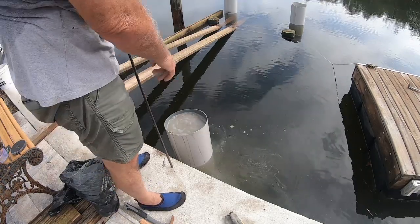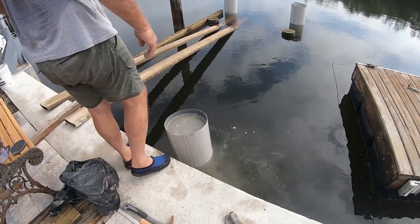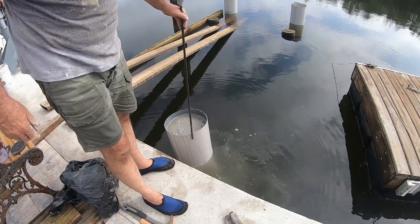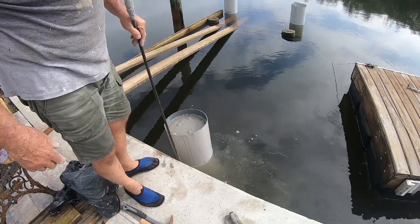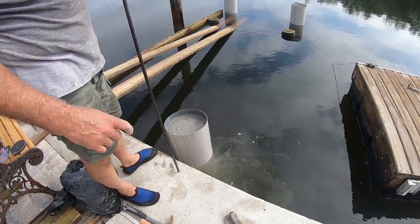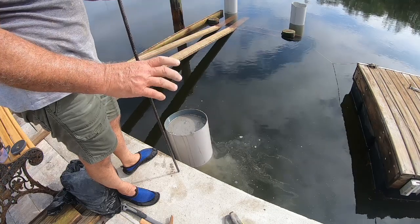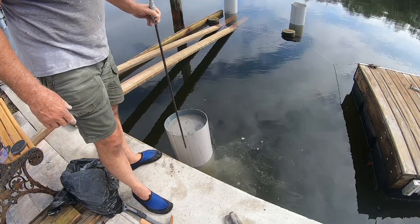So the plan is then, this is just water at the top. When the cement sets up, I'll eventually probably cut off the top few inches of this, which will be the width of one of these rafters, which is about 7.5 inches, plus the thickness of the decking, which is about an inch, 5/4 is an inch. So that's 8.5 inches down from here to the top here.